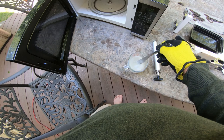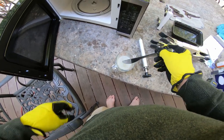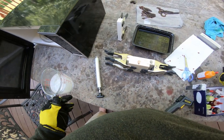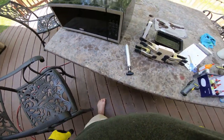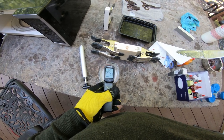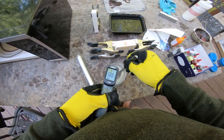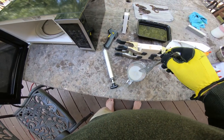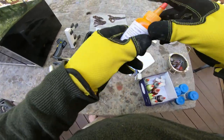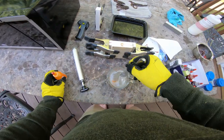You see these bubbles — don't freak out. They look bad now because the plastisol is still pretty viscous and the bubbles aren't really traveling up and out yet. It's starting to foam up like a beer — just let it roll. The hotter it gets, the fewer bubbles you'll have. We're at 375 — getting up there, see how it's getting really runny. At 388–390, that's probably pretty good.